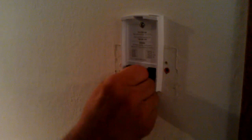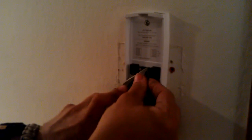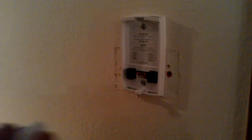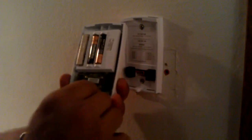I tuck my wires in there — they get a little tight towards the end so I kind of start shoving, but just tuck them back in the wall. I kind of use the tip of my multi-tool to persuade them into where they actually need to be. Once you get them all tucked in there you can't really see them anymore. The end part is the easy part. On the back here you've got hot gas and hot electric — that's the HG and the HE. There might be something like that. It's just a little pull-off thing — make sure it's on the right terminals. They usually come correctly set for most gas systems. And thanks for watching the Maintenance Man.